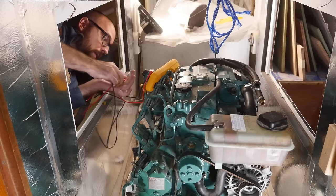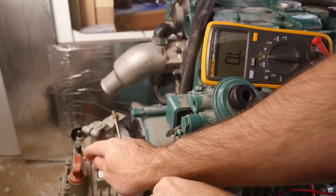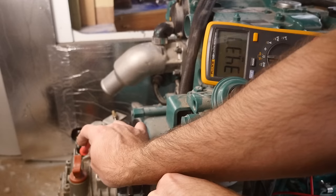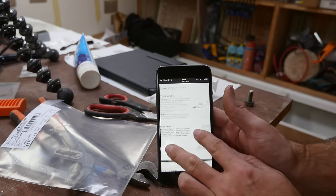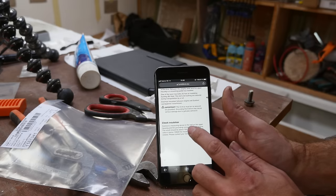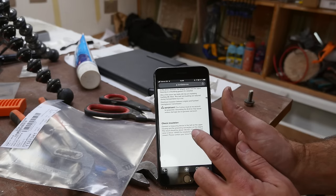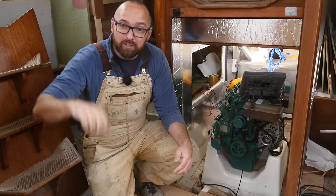Remember, any value above 100 kilo-ohms is acceptable. Using my trusty old Fluke 15, I am getting somewhere right around 30 mega-ohms. 30 mega-ohms is a ton better than the 100 kilo-ohms mentioned in the instructions. For anyone doubting this is actually in the instructions, this is page 12 of the official installation instructions: connect a measuring device to the bolt on the upper housing and the grounding connection on the engine — the result should be above 100 kilo-ohms. I think we can consider this installation reviewed.